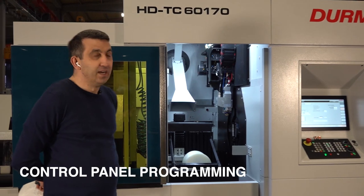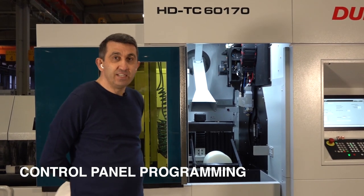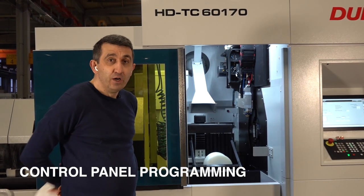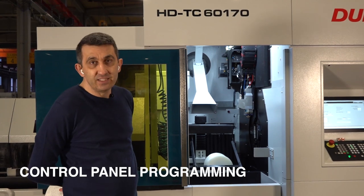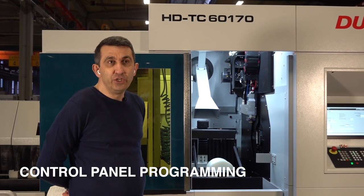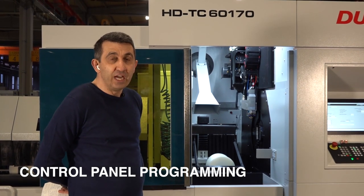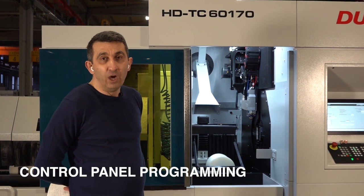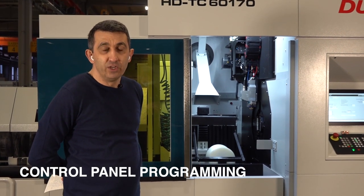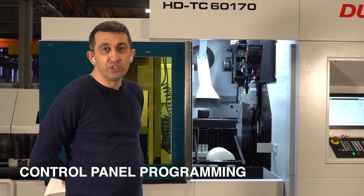We have a Lantek Expert Insight option, we call it. It's not available on that machine. For example, with the help of this software option on the control panel, you can add some micro joints, you can cancel some micro joints, or you can play with the nesting. You cannot import any SAT or STEP files onto the computer, but you can work on the computer itself with previously loaded drawings on the control panel. You cannot create a new program, but you can revise some previous programs on the control panel.